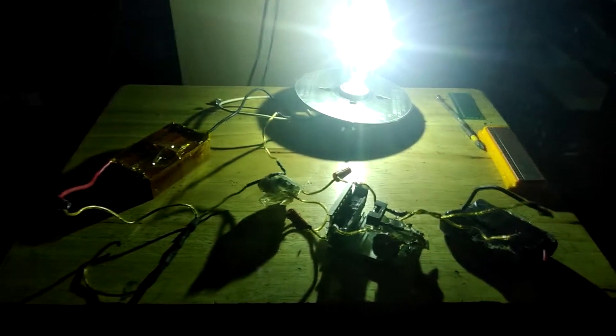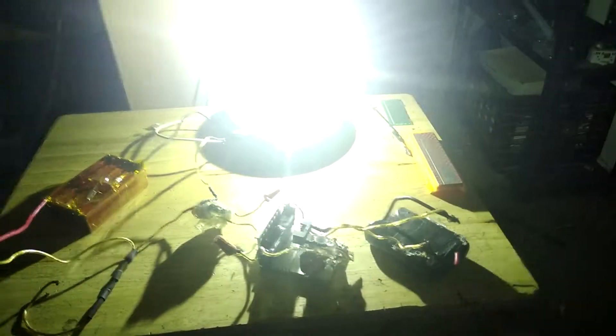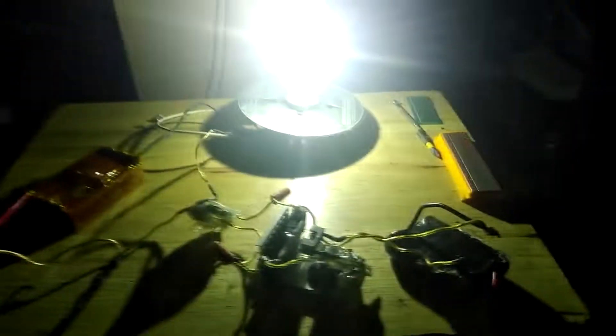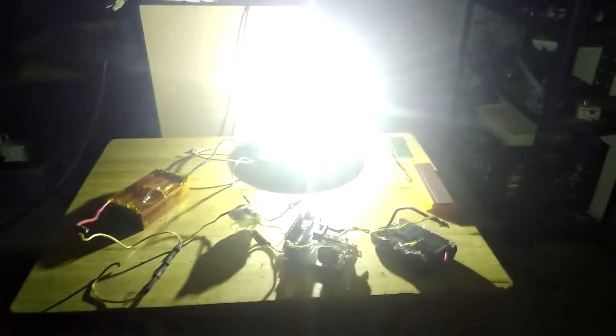Can't even really block the light coming off this thing — kind of strange. It's pretty cool — just a little cheap 12-volt setup, not really high-current cells or anything, so it's not going to push a couple amps for a super long time. But it's pretty cool running a little metal halide off a battery like that. If I was to design a lighting circuit using this setup instead of LEDs, incandescent, or fluorescent, this metal halide is actually a fairly efficient option — not pushing way more amperage but getting decent light. LEDs are obviously probably the better way to go efficiency-wise.